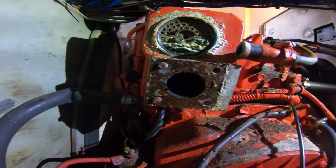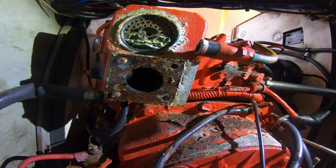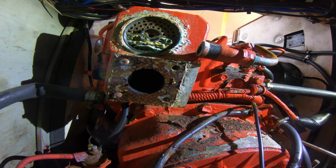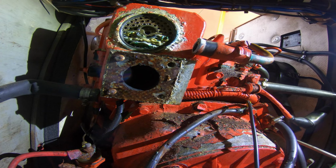The problem with broken studs and things like that is if you try doing things by hand, we're just not very accurate. And I'm drilling into cast aluminium. Steel into aluminium, the aluminium's going to give up if I slip, and the chance of getting concentricity of that is going to be difficult. So this is going to be a bit of a challenge.